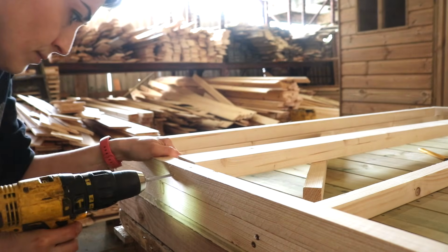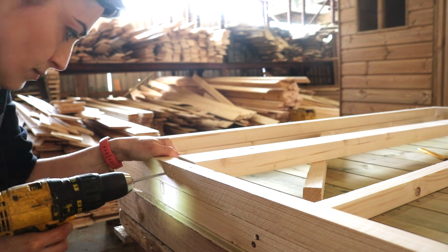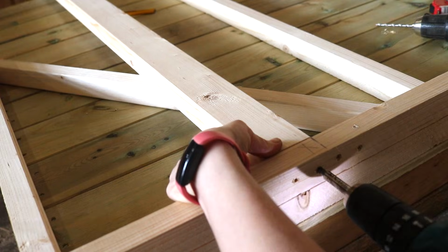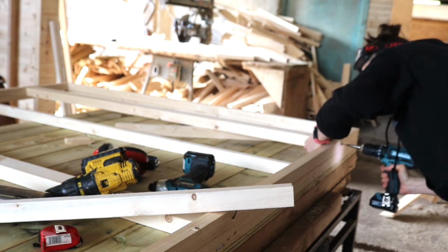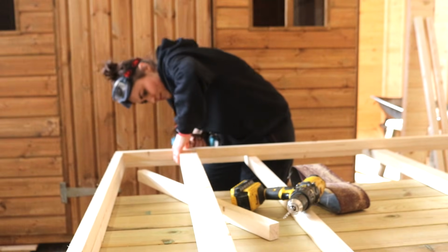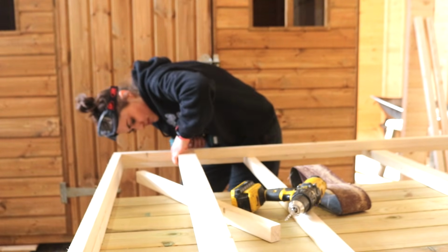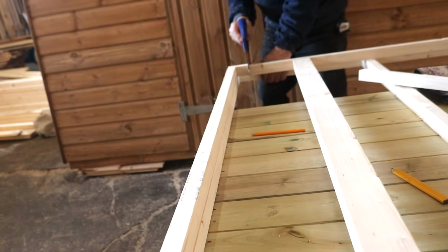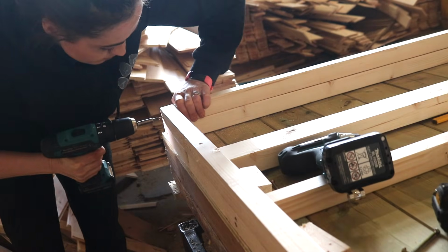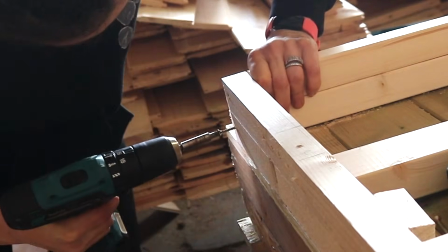But when it came to the spars, most of the front panel would be taken up by double doors held by heavy duty hinges. So I screwed in some wide CLS spars either side to allow for them. In fact, all of the other framework is also the same CLS timber, but it's all ripped in half. Oh, and this is where the front and back panels needed to be reduced down and screwed back for the flashings to be at the front, not the sides.